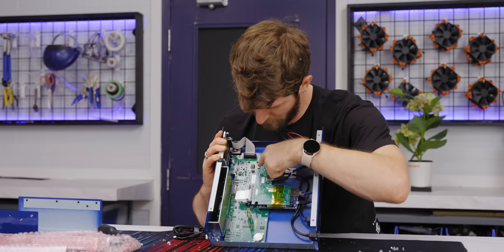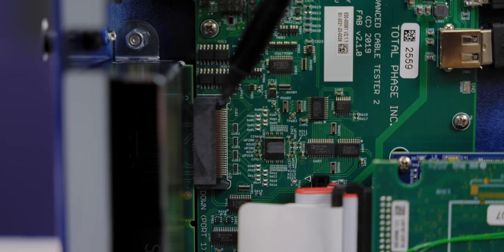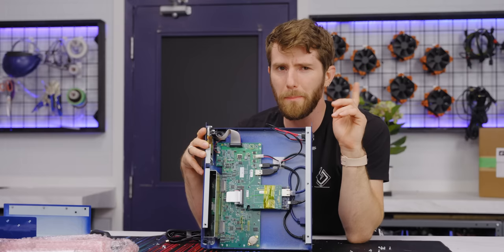They've worked some clever modularity into the design. Our test interface sockets, each with similar circuitry, come out right over here, and then they feed out into what appears to be the processor stack on a separate mezzanine board. We did note a couple of manually soldered wires, but Kyle from engineering says they're I2C lines and won't affect anything.